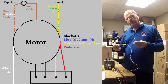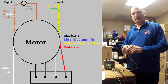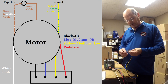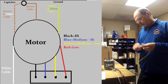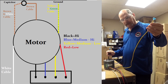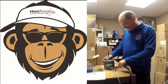We also have a couple of other speeds that we can switch to if needed in the future. Unused speed wires usually go to a park terminal on the control board. If you don't have one, just tape up the ends and coil them up neatly so they don't get wrapped up in the blower wheel while it's turning — because once the motor is running, there will be voltage on those leads. Yellow is medium-low speed, which is the next step up from red. Blue is medium-high speed.